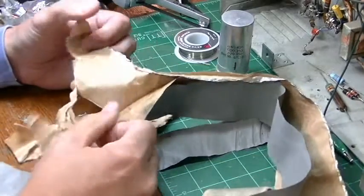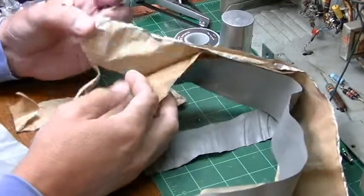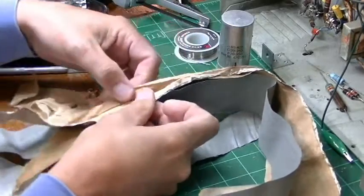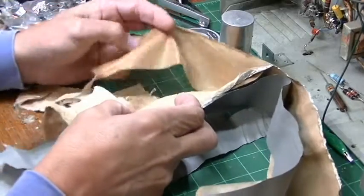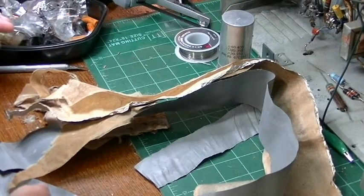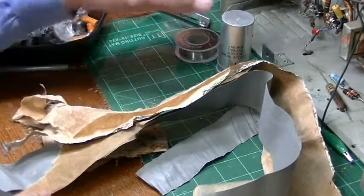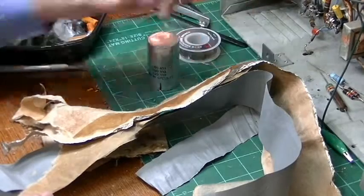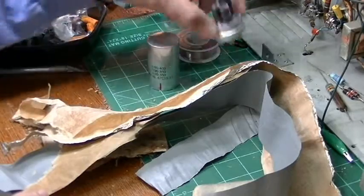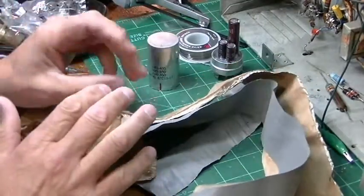What's interesting about this one is, if you recall from the last video, this capacitor tested pretty well and it is still nice and moist with a very unique smell. When you can smell that well and the material is still moist and hard to pull apart, it's no wonder the cap was still working. But the set will be better off long-term with brand new electrolytics — these will last 20 to 25 years. With the old one, you never know when it's going to go.